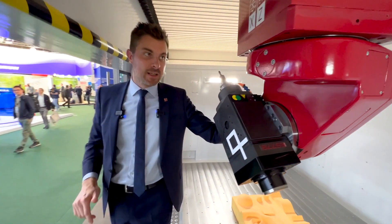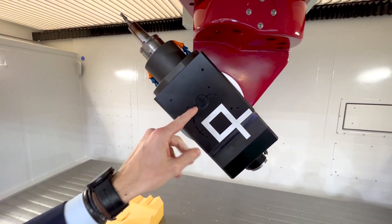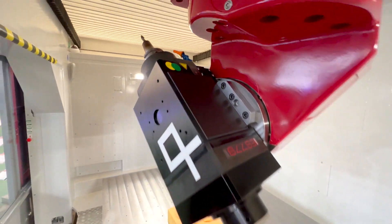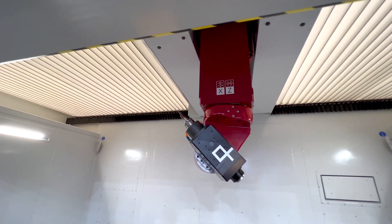Because of the specific design of this head and the offset we provide in the spindle, we can allow the A-axis to reach an inclination of 135 degrees, enabling all your undercuts and all your work under 90 degrees.